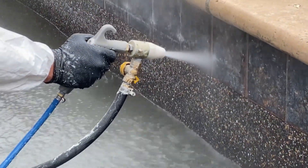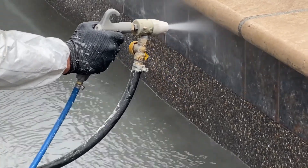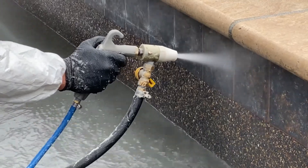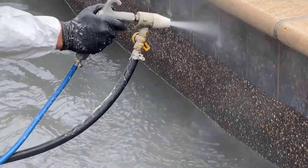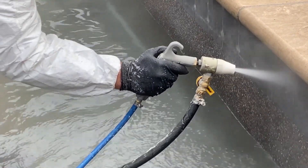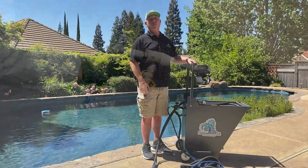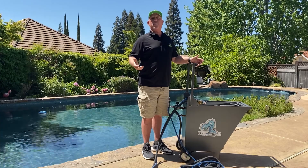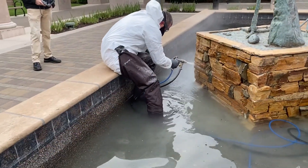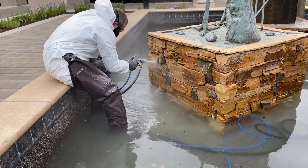This is a great machine for the pool tile market. But is it just as viable for any outdoor blasting application? The answer is yes — you can use any media: garnet, glass bead, aluminum oxide, crushed glass, disposable medias — any media as long as it doesn't float. You can prep something for powder coat and give it teeth and profile. This same machine, if you want to do a car body, graffiti removal, or any type of outdoor blasting that you typically do with an outdoor blasting pot, dry or wet, you can do it with this and use much less air. It's not just a pool tile machine — it's a machine that will do any type of outdoor portable blasting.